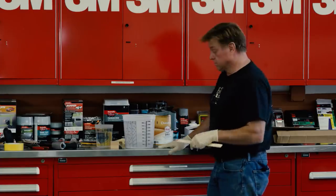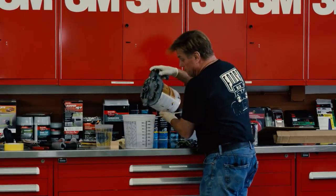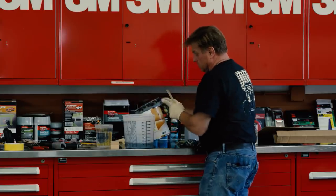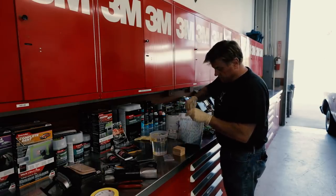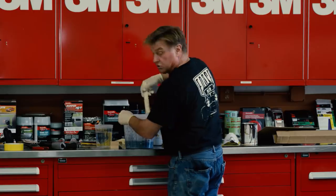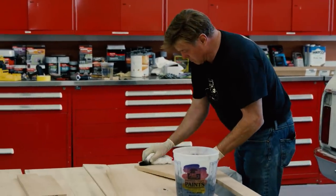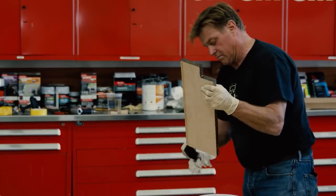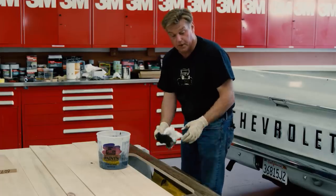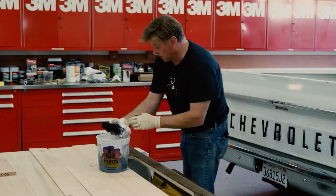For this project I'm making my own stain. I've put a little acetone in the bucket and I'm using some black automotive paint to make an ebony stain. It won't take much of the paint. I'll mix that — it makes a very translucent black color. Then I'll use a rag and wipe it onto the wood. I'm using a rag to put this on; if I were to use a brush I'd be making a mess. The rag will hold the paint or the stain and the wood will absorb it.